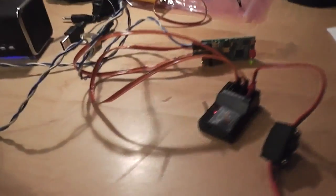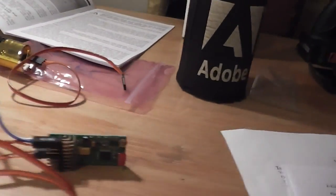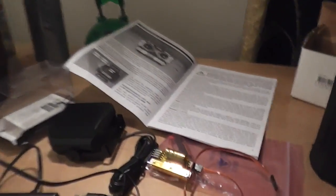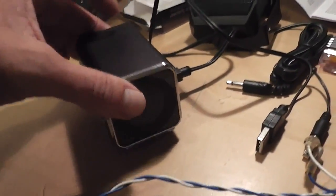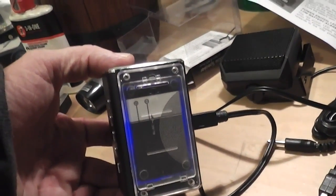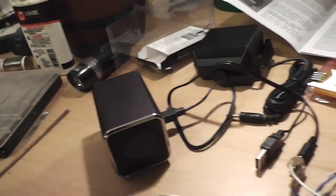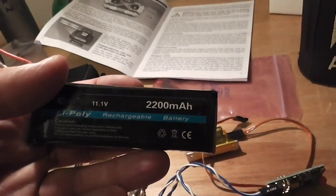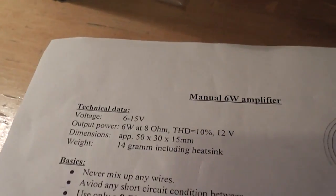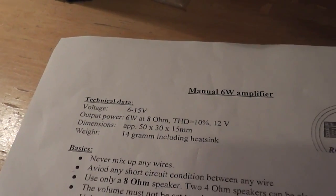That's — I rate it pretty good thus far. She's plenty loud. Wherever I use — this little six watt external amplifier or this box here — undecided at this stage. This box here has its own built-in battery; it's a cell phone battery by the looks of it, chargeable USB, five volts. This little external six watt amplifier runs off an 11.1 volt LiPo. I believe it's rated anywhere between 6 and 15 volt input. There are the specs there.